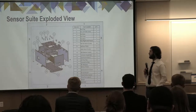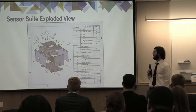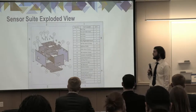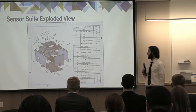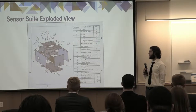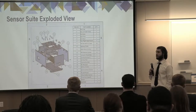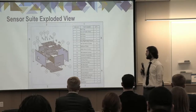At the top of each of the plates, you will see a rectangular extruded piece. That is our fastener, which the screws go into from the top plate in order to fasten them in. It is different than the base plate, which has an extruded ring design. All of the side plates on the bottom go straight through into the base plate. This was to ensure that we did not have any screws on the bottom of the base plate for surface reasoning within the airplane.